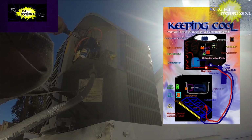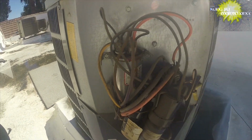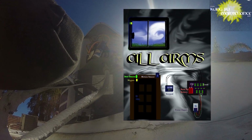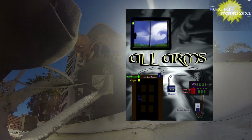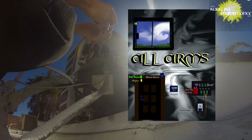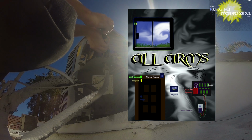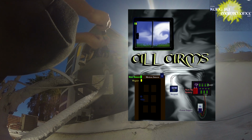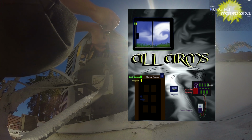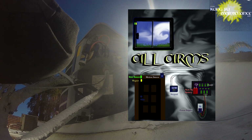I've already pulled the disconnect. Capacitor looks really rusty and old, and it's got two hard start kits on it, so definitely something was giving some grief. Let's take a look at our contactor. It's got a little dust cover on it, so I'm gonna remove that so we can see if our contactor is pulled in. Contactor is pulled in. Points look really good.